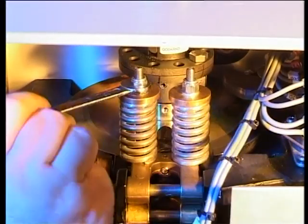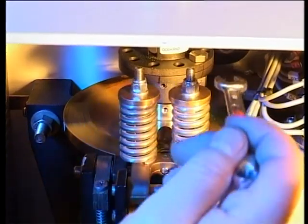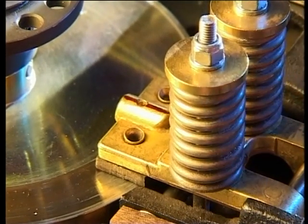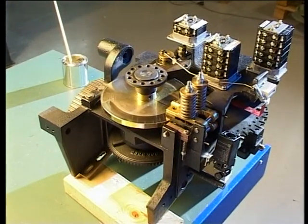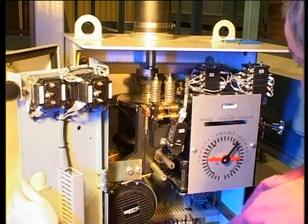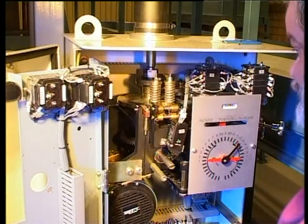The braking force can be adjusted by tightening the springs in the brake. Crank the motor drive mechanism until the brake is fully open — in this position, the springs must not be fully compressed. If the brake still does not work, there is probably oil or grease on the brake pads. For cleaning, see section 3127 of the maintenance guide. Check that the operating contact brake prevents the link system on the operating contact shaft from swinging past its normal position when the operating arm roller comes free of the cam disc. In the final stage of a switching operation, the contacts for switching in the opposite direction must not move when the red position arm swings back to the normal position.